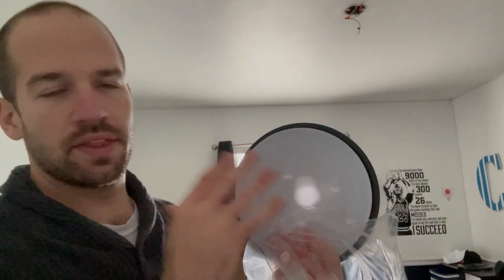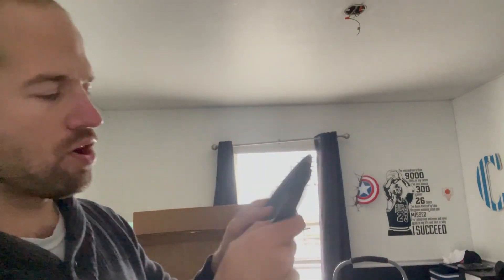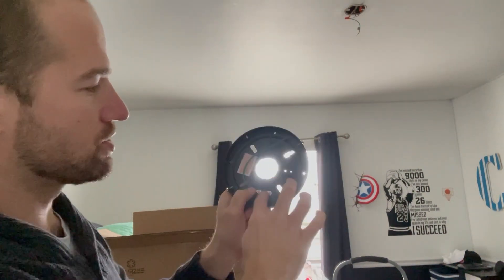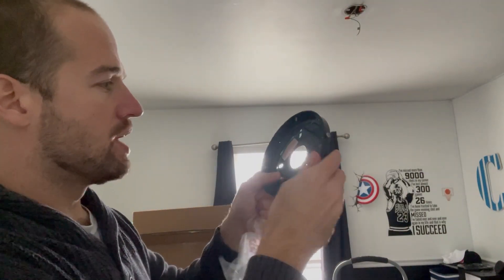So I'm going to unpackage this with you. You got the light — there it is. You'll put this up last. This lamp and fan doesn't require consistent light bulb replacements — it's actually powered directly by your electricity, including the light, so there's a little power outlet inside. This piece here you'll recognize as the last thing you took down from your previous light, so this is going to go up first. It has a ground wire already there, which is great, and it has a hook — always remember where those hooks are, that's where you'll hang the light while you connect the wires.